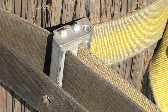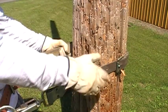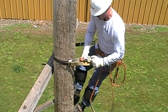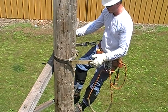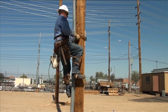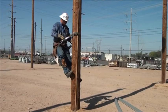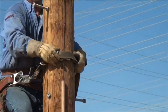Constantly check the position of the PC roller and make sure it is against the pole. When climbing or descending, take only two inches or three fingers of slack in the unit. Be aware of the position of your hands to keep them from interfering with the operation of the pole choker. The cross strap must be connected when climbing, descending, or working more than two feet above an obstacle on a pole. Climb a pole that has U-guard on the side the U-guard is located, and keep the PC roller engaged on the pole. The pole choker can also act as an extra set of hands when installing U-guard on a pole. Step poles can be climbed with the added security of the pole choker by simply working it over the steps as you climb.